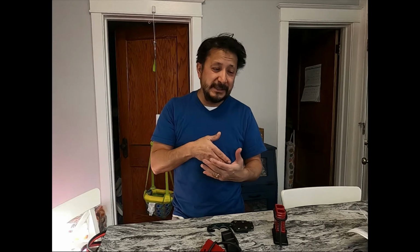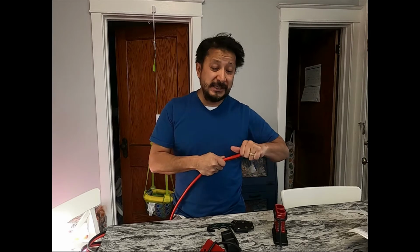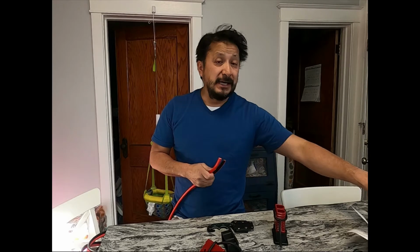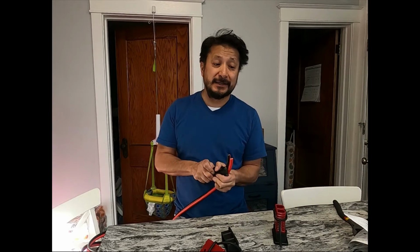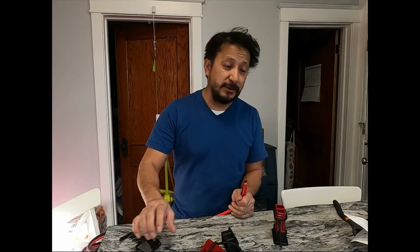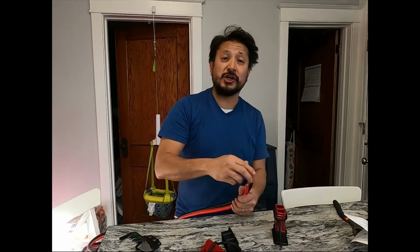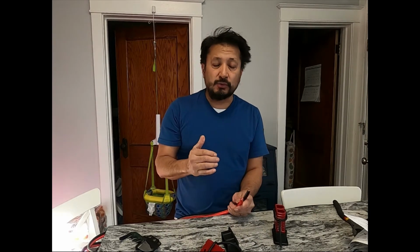So then this way, I vented the cooler so nothing can damage or hit them or fall on them, or if something falls on them, if something breaks that lithium ion pouch, it could short out, or if it gets oxygen, if the pouch gets oxygen, it could set fire. Look up lithium ion fires, and then you will realize how dangerous lithium ion can be if it's not handled properly. I seen a guy not put a battery management system and was charging like 6,000 batteries, and lithium ion is like a runaway train.